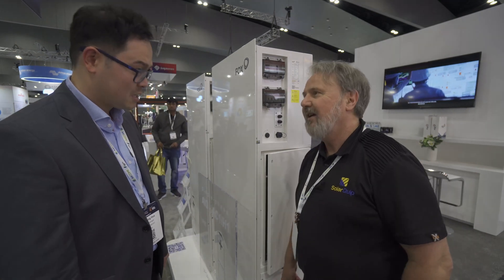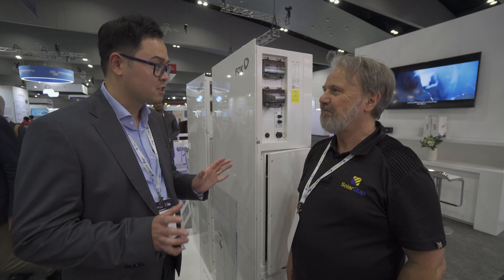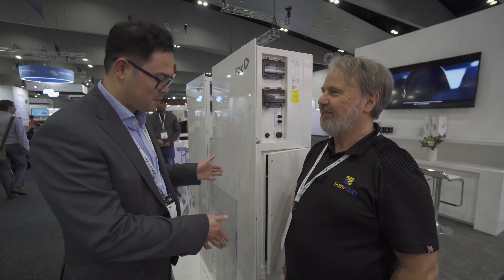We call it snap installation. This is a freestanding unit - it just bolts to the ground. No walls required. We do have mounting for the wall as well, but we recommend putting it on the ground. That's a big plus - if your wall is not suitable or not strong enough, or if you want to be away from the wall for protection. The standard gives you 300mm clearance and no fire barrier required, which is a big plus.